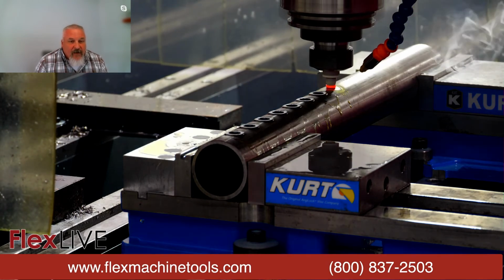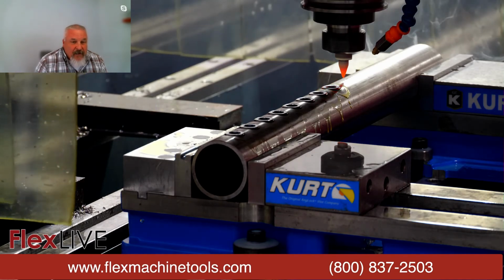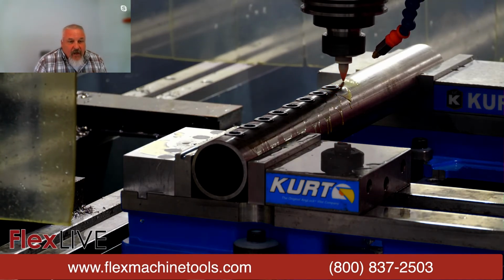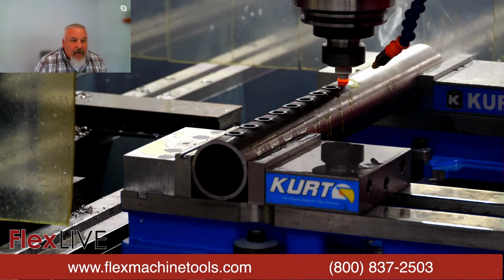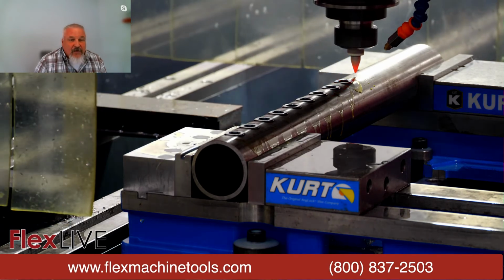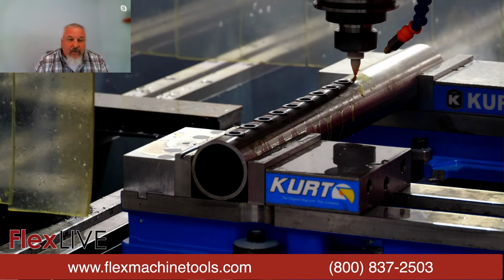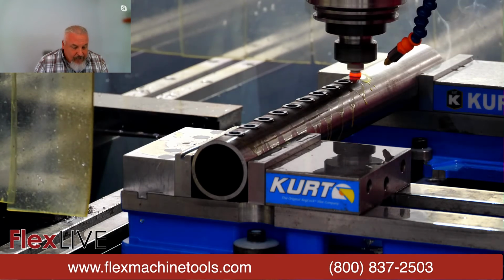The Flowdrill itself can be used in most any malleable material. Today we're using mild steel. If you've got stainless steel applications, all we do is modify the parameter and we can use stainless steel. You can switch next to aluminum, copper, even some brass material. We can flow drill successfully.